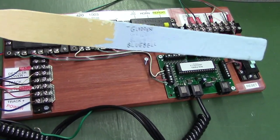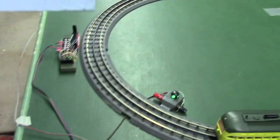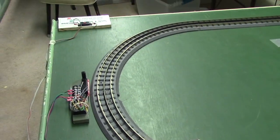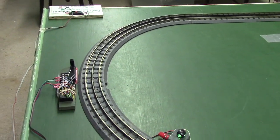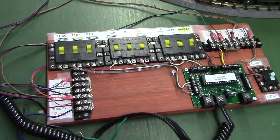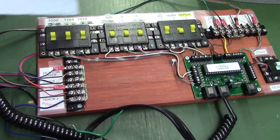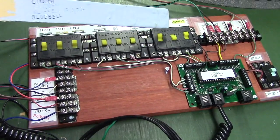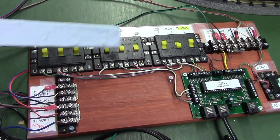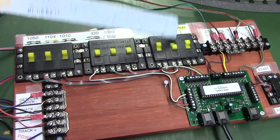Basically, this switch, when it's pushed in the start position, does the same thing as that public push button out there we were using. They're wired in parallel. You can have as many input switches wired in parallel as you want. All it takes is any one of them to ground the input, in this case input 1, to start the cars up. And then here we've got 3 Atlas 205 connectors, and these just allow us to connect these inputs to ground or not connect them to ground, whichever way they're pushed. If it's pushed toward where we're standing, it'll be grounded.